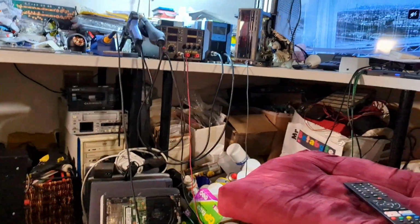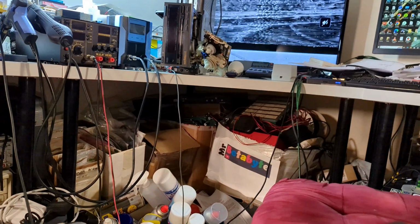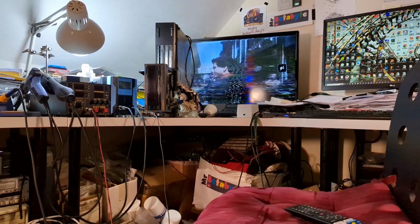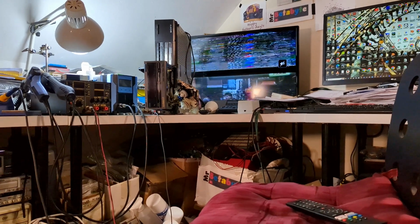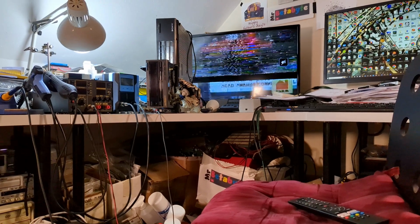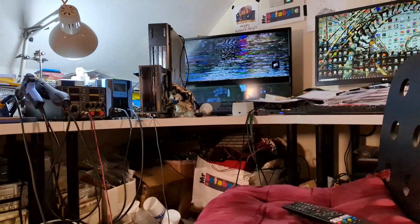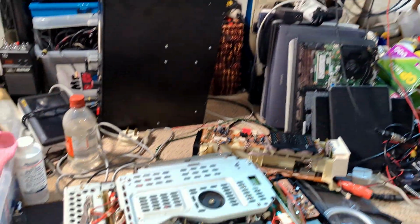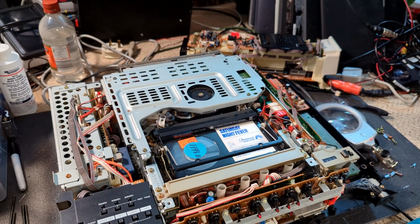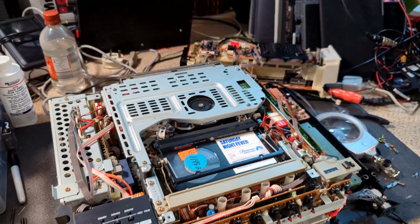Oh, that's a bit all over the place. Oh, I nearly had a proper picture. It's almost like I do have a head chip problem. But my feeling is I've probably got an RF issue. So I might have to put the scope on and see what the RF looks like from each head chip. I'll need to work that out from the manual because obviously this is a 4-head machine. It's going to be a bit interesting because the manual is not that clear.